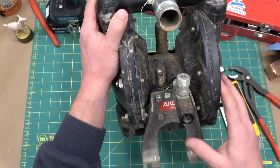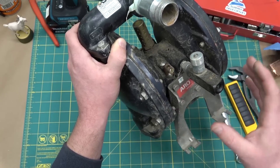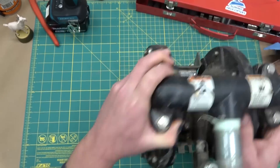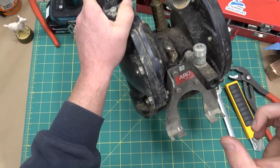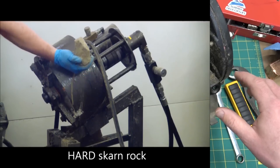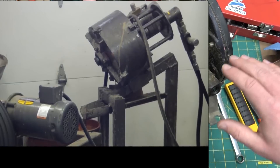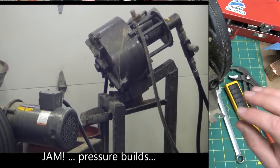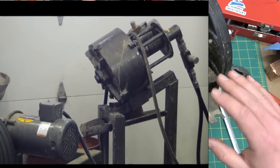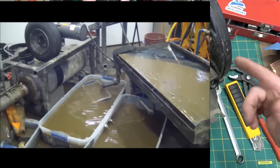The construction that makes it so robust is that the pumping elements are always separate from the flow of fluid being pumped — so that allows it to handle slurries and fluids. I was using this one for my mini pilot plant, crushing ore and separating the gold out. I was using these in the slimes and the tailings to get rid of them. As long as we didn't allow the slimes to settle out and cement together, this would pump it no problem. If I did leave it for a day or a week and it cemented together, all I'd have to do is put some water in there, mix it up, and this thing would self-prime and pump it right out.